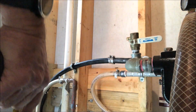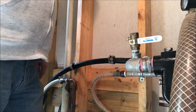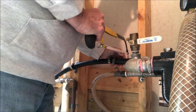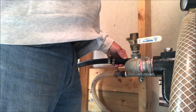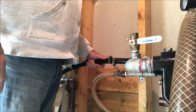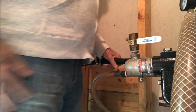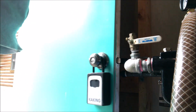So while I'm doing this and thinking, I don't know that it was that valve, we'll see. The tank was not charged up much, but I don't think that would cause it. So the only thing I can think of other than that is I'm going to have to go out in the lake and check the intake valve out there. It's a check valve. It gets coated with stuff, but I don't know why that would cause the pressure not to build unless it was blowing back out that way, and I would have thought I'd see bubbles coming up, which I didn't.